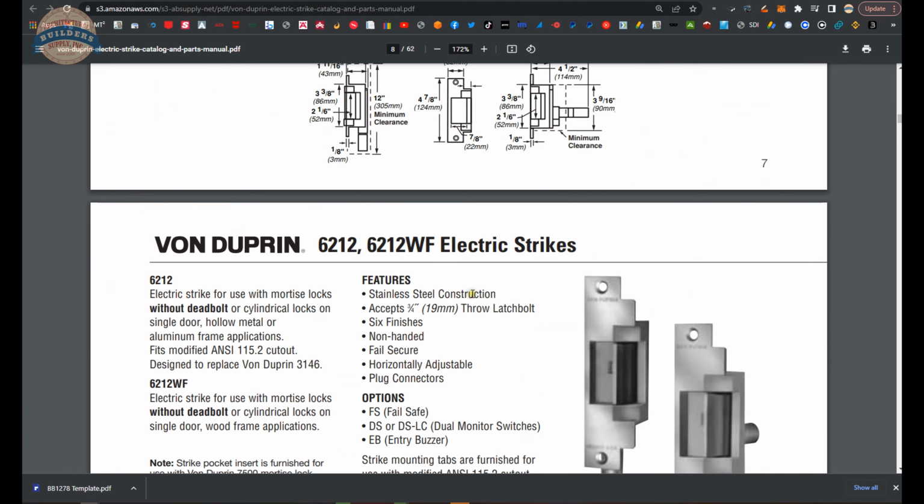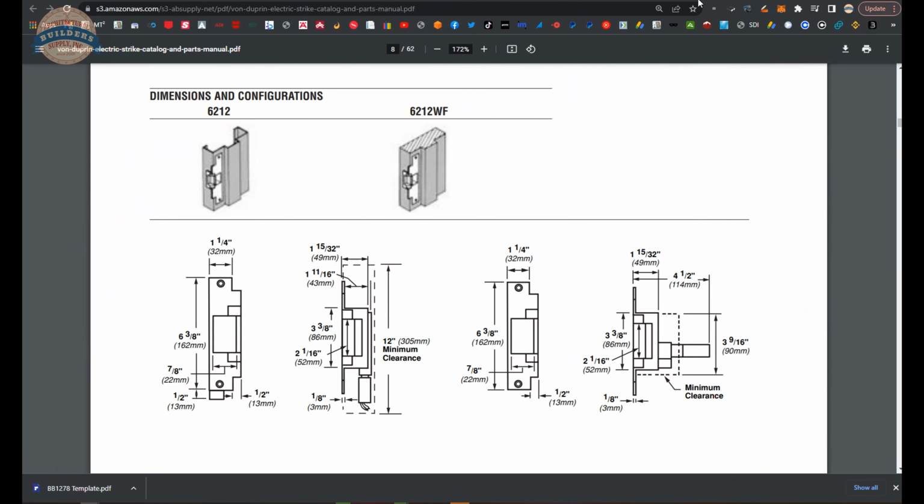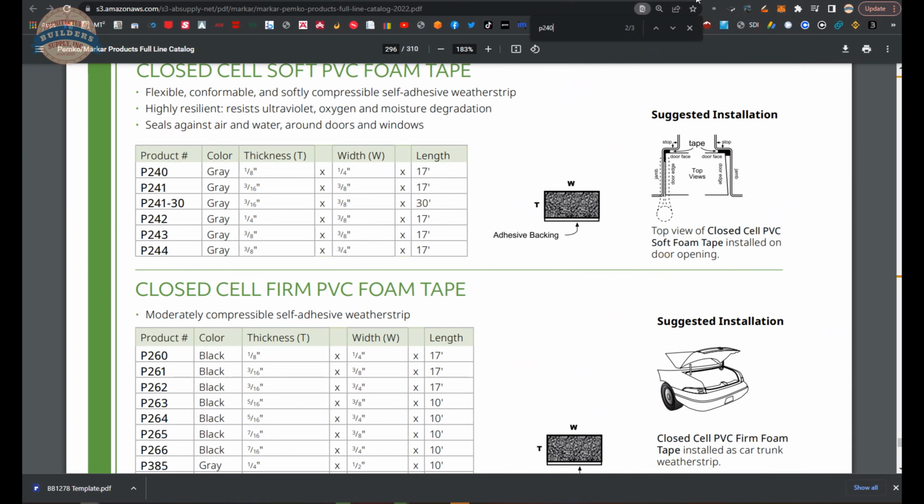So that's a concept. I didn't invent that concept. That concept exists by other people, but it's probably going to be least expensive to simply slap on some foam gasketing and be done with it. What I would want to see happen is that the frame get Dutchmaned and remortised in the proper location. That's the bottom line. That's my official opinion. But in reality, that may not be even remotely what you're up for after being in the construction biz.